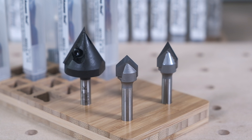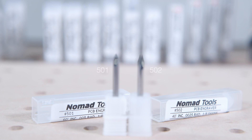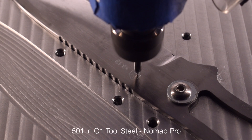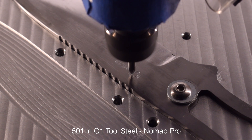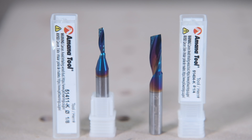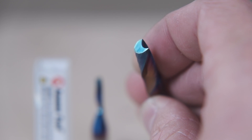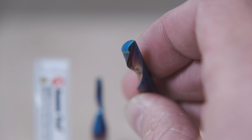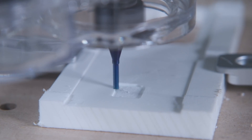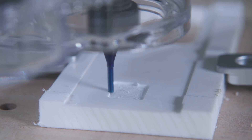End mills for aluminum need to have a much more aggressive angle on the cutting edge. If you want to trace really fine lines, the PCB engravers we sell will do more than engrave PCBs — they'll mark aluminum just fine, or even small amounts of steel if you're careful. If you want to maximize your odds of success in plastics, specialized single flute end mills might be worth a look. Plastic-specific end mills tend to have the most aggressive angles on their cutting edges and extra deep flutes for better chip evacuation. We offer a set of Amana end mills just for this purpose. Note that the sharper cutting edges and deeper flutes come at the expense of outright strength, so an aluminum cutting end mill could be used on plastic, but not vice versa.